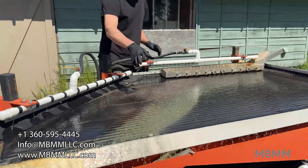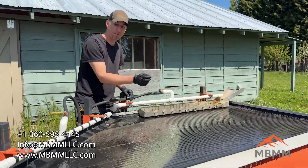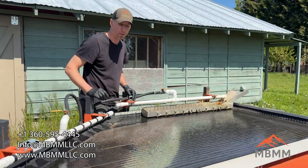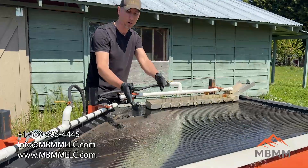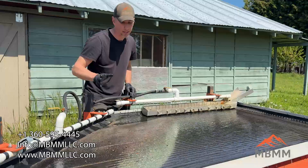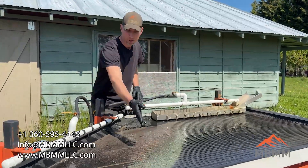One of the reasons why the fiberglass is working its way down into the number three is because I'm not feeding it fast enough — I don't have enough sample to get it on the table fast enough. So it's just worked its way over to the cleaning plane, the ramp, and down to the number three. That's fine — you're getting really, really good separation between the metals and the plastic.